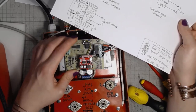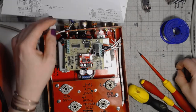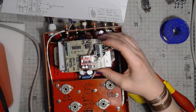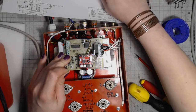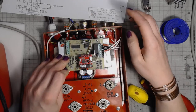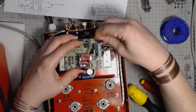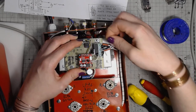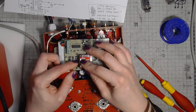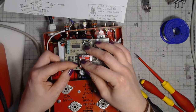This relay transfers the input of the amplifier to the Bluetooth module, and also, using this MOSFET transistor, it turns on the power for the Bluetooth module. So when using the RCA input jacks, the power to the Bluetooth module is cut off, and it doesn't connect with the audio source, so as to prevent getting confused,